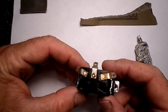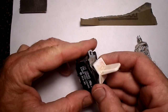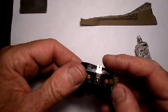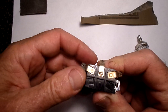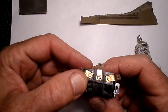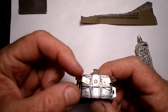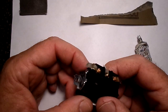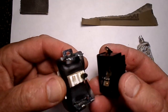Here's one that I've already taken apart, but I just thought I'd go through the process to talk a little bit about it. If you look at the switch here, it's a two-position switch — it's got actually three positions: center and then one on each side. It's a momentary switch and it's got three contacts on it, so it goes from center to this side or center to this side when I switch it.